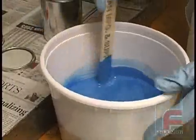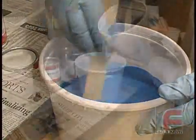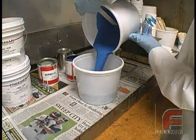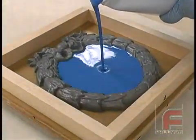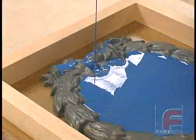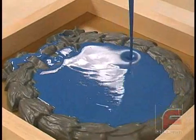So we are weighing 1,600 grams of the A side and 1,600 grams of the B side. For complete instructions on weighing and mixing of materials, please see our other video on this topic. Finally, we are ready to pour the Repro into the mold cavity. Notice how the thin viscosity allows for easy pouring, even into the highly detailed areas without entrapping air.